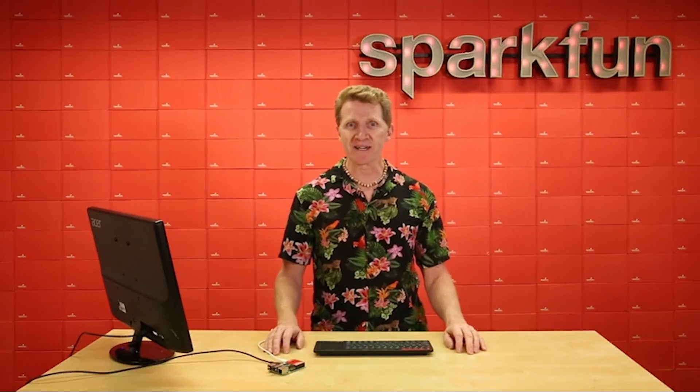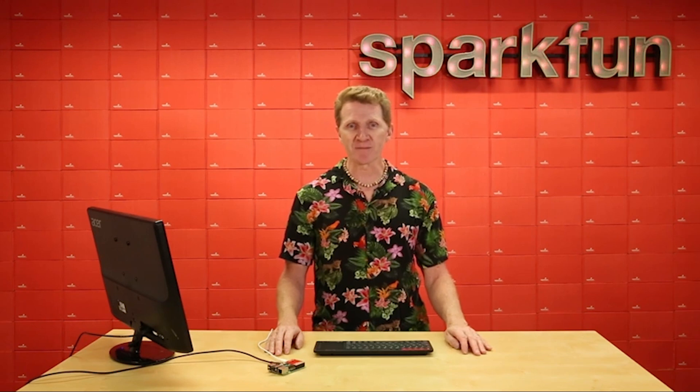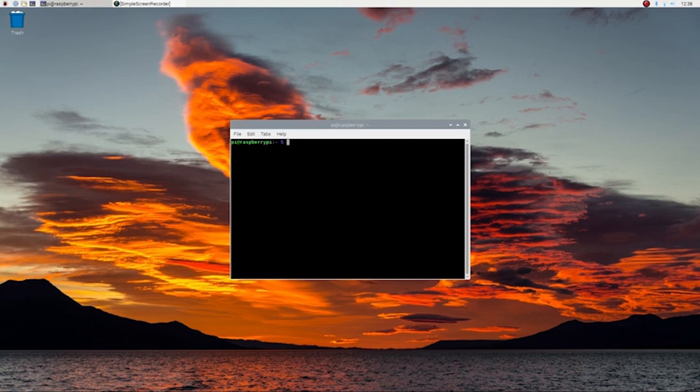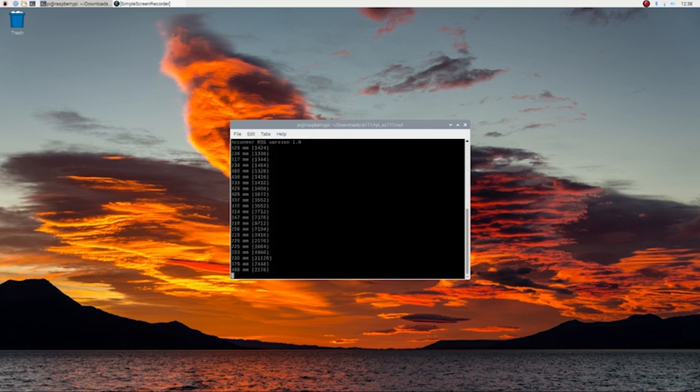If you're familiar with terminal commands, then this will be pretty straightforward for you. If you're not comfortable with them or are just getting started in the Raspberry Pi environment, then the Pulsed Radar Board Hookup Guide is going to be a great walkthrough to help get you familiarized with the terminal and its commands. In the terminal, executing the makefile and its recursive dependencies should build all the examples you may use with the A111. Once compiled, you can run the example applications. Navigate to the Out folder with the CD command in the terminal window. You can run the example by clicking on the executable or typing the following commands. We definitely recommend typing the command into the terminal to view the data. The application will continue to run in the terminal window until Ctrl-C is pressed.